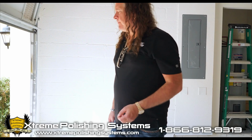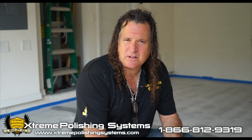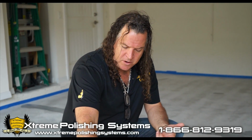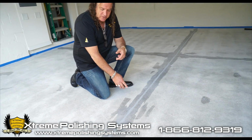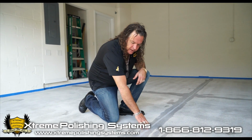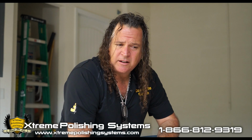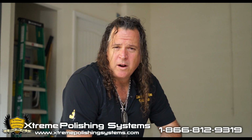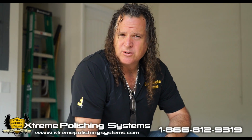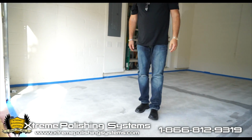Point, once again, okay, we've ground the floor with our concrete genie with a 16 grit diamond. We have made sure that we got the floor really clean. We have routed out our cracks, our joints, and we filled it, okay? What you want to make sure is that it's dry to touch, okay? This product took a little bit longer than we were expecting it to take to dry. It took about 4 hours to dry. So we went home yesterday and got back and did some other stuff at the office. So we came back here this morning, and we're gonna put down the red epoxy, and we're gonna watch Jimmy as we mix these up, okay?